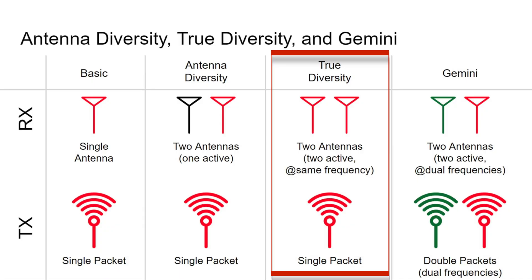And we're still talking about a single transmitter, one antenna. Then we've got something called true diversity. What this is, is your receiver has two antennas and two proper receivers built into it. It can have both antennas active at the same time, and obviously it can take the one where it gets the packet and discard ones where it doesn't. So you've got two chances to get the packet through, but again you're only sending the one.